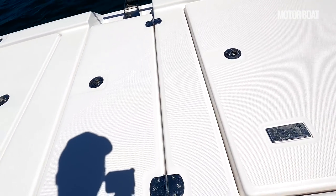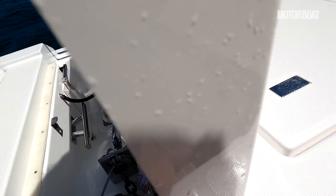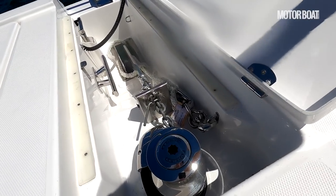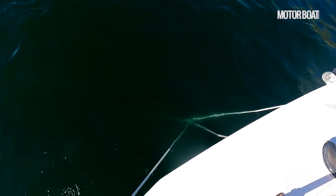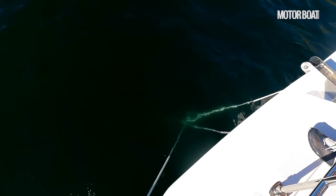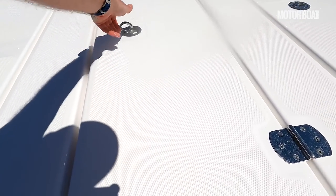There's another matching locker on this side and then the anchor itself is under here. There is the anchor — it drops down in between the two hulls with an electric winch, and then there is a bridle. Because you've got the anchor right in the middle and there's a danger of the hulls swinging around it, you put a rope bridle out on either side that holds it nice and centrally in front of the boat.